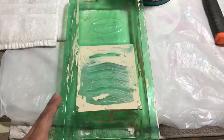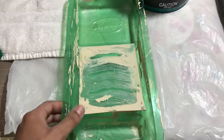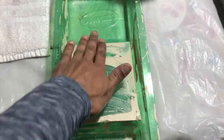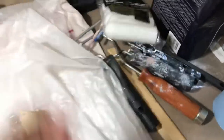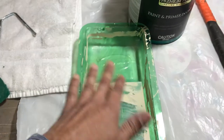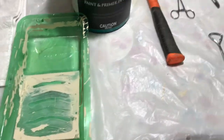Here's a paint tray. One of the things I did was put a piece of plastic here. Normally these trays — just regular Home Depot stuff — come with a little ribbing material to kind of squeeze the paint out. The problem is when you use the foam roller like these guys, when you use it with the ribs in the way, it picks up that pattern and that pattern gets transferred to the wing and it's really hard to iron out. So the piece of plastic works really well here.